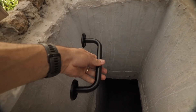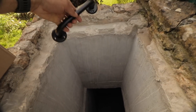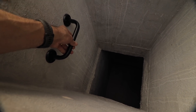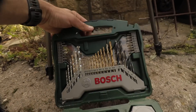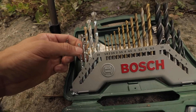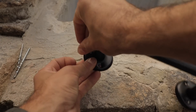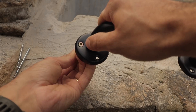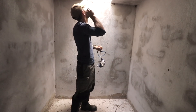That's the rung — it's going to go against the wall like that. This is going to be so good. Rather than having a fixed ladder in there, I'll just use these rungs. I've got seven or eight in this box. I need a masonry bit — a four mil pilot hole and then a five mil should do it. Let's just check the screw. And hit plugs.